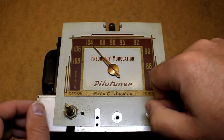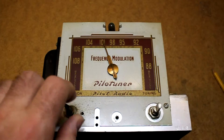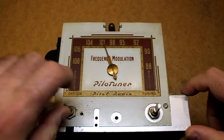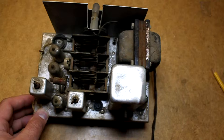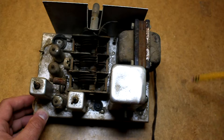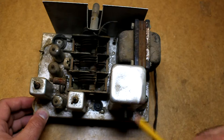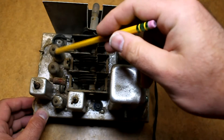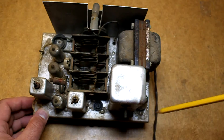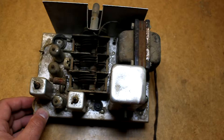Taking a look at the front of the tuner, the tuning knob works. The on/off switch is also working. There's an old light bulb up here that's going to need to be replaced. Now looking at the top — it's kind of dirty. The main power transformer I've already tested and it appears to be good. There was one tube missing over here. The other tubes I don't know if they're any good, but I do have replacements on hand. This is the large variable capacitor for tuning — we'll see if that's good when we try to receive something.